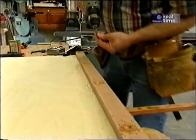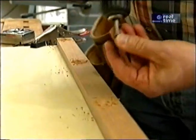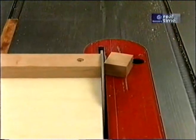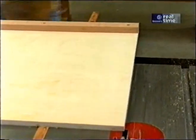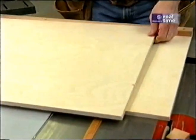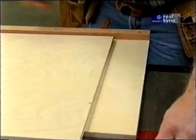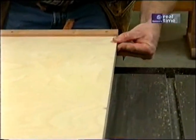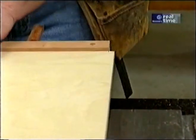I have pre-drilled holes, this time for one-inch screws. Now I can trim off the stop and give it a test run. If I want to cut a panel, I mark my length along the back edge, slide it up against the fence, and bring the pencil line right to the end of the stop. That way I know it's even with the saw blade, and run it through.